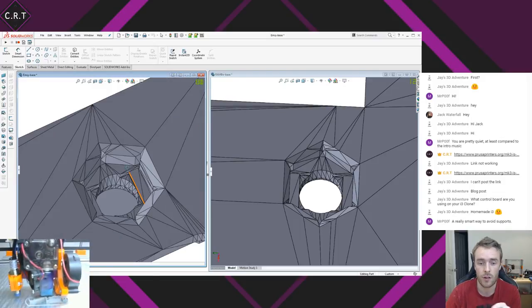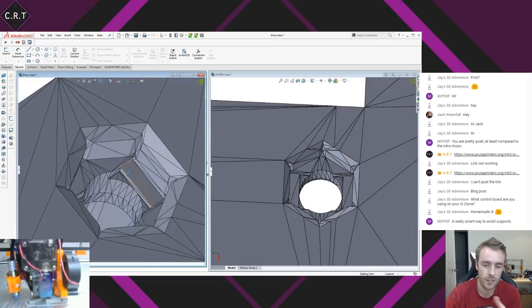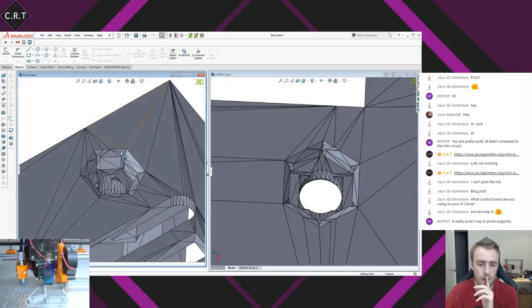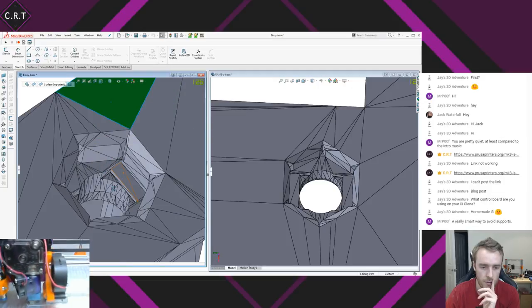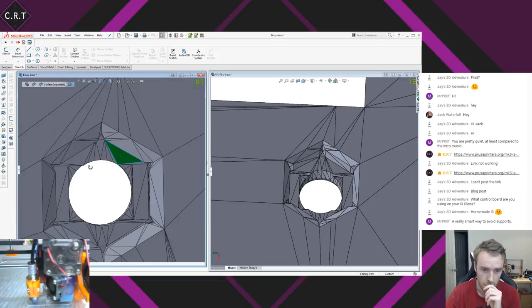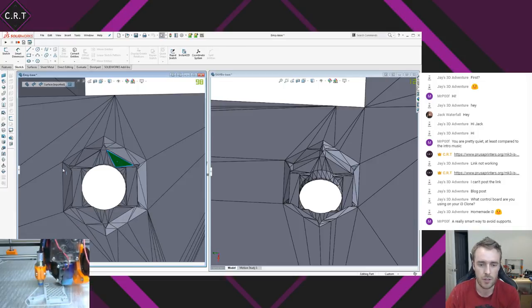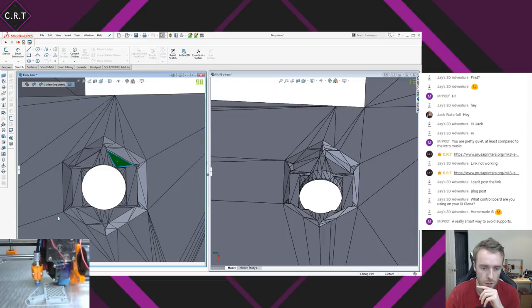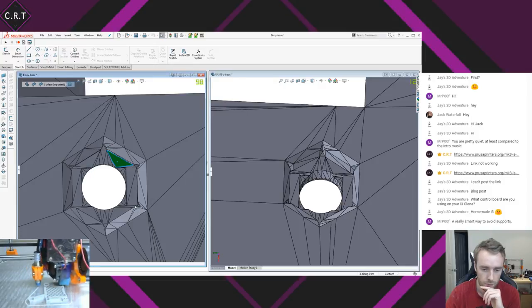And then in the bottom of the hole, it's basically a designed filament, a designed extruder path. So as you're coming up, obviously you start on this face here and you build it this way. It'll first do the hex, and then when it comes to this part, it'll basically draw straight lines across here without going into the hole, probably. It might do some interference with the hole. It's strange that they haven't gone all the way to the side. But instead of trying to cover the whole hole at once, it'll do this side first, the top and bottom, and then the left and right, and then it will fill over these corner parts.